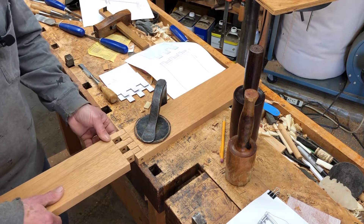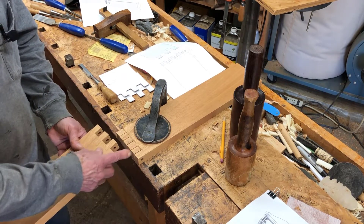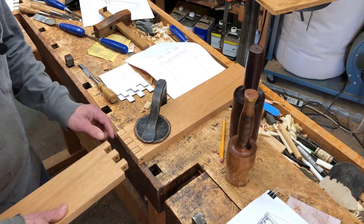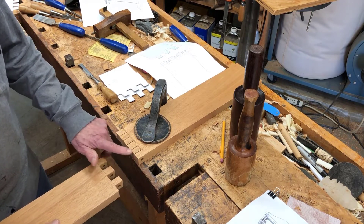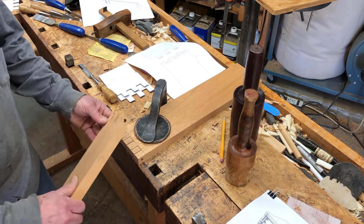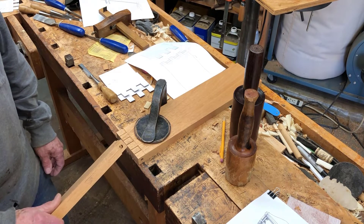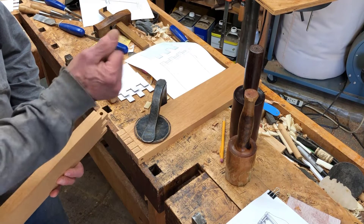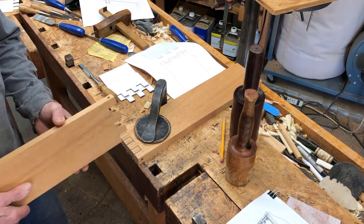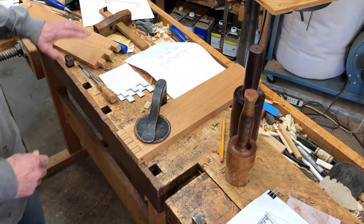After marking out with the marking gauge, I went to the band saw and cut out these parts. You can see that I've marked the teeth that actually get removed — that's what I'm in the process of doing right now. I drilled the holes before any of the cutting, drilling from the top down on the drill press, then turning it over and drilling the other half. So those holes were already there.